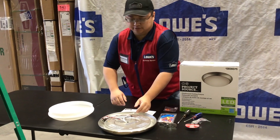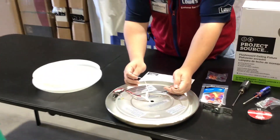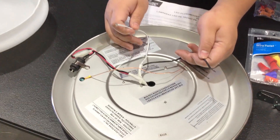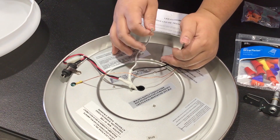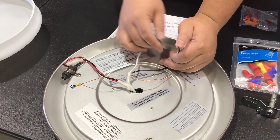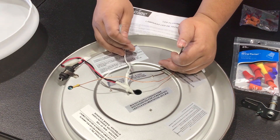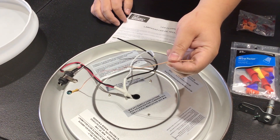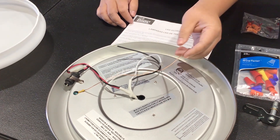In most situations, unfortunately, wiring isn't always universal. More often than not, you'll see just two wires coming out — black and white — coming out of your old fixture or out of your junction box. Some older homes you'll just see black wires coming out, but that's not a problem. As long as you go two for two, or one to one, you should be fine. This third wire here is just the grounding wire, and that should match up pretty directly. Usually that's a smaller gauge as well.